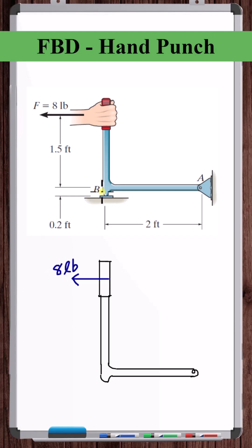At point B, the contact between the hand punch and this surface is a smooth contact. That means that this reaction force must be perpendicular to the face of this stop, because there's no friction force parallel to the surface. Visually, we can see that the face of the stop is horizontal left to right, so this reaction force will be straight up and down.